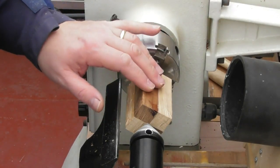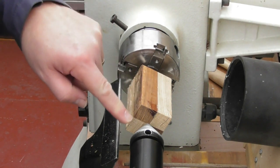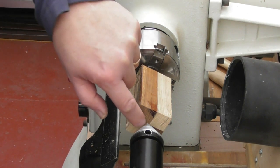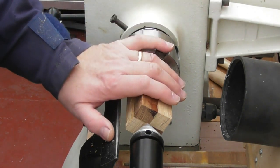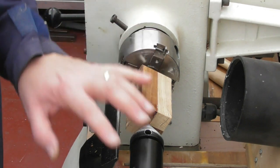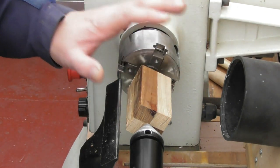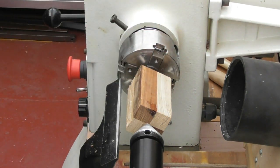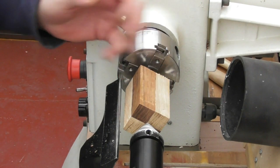The blank I've started with here today is one I've had glued together for quite a long time and in my infinite wisdom I haven't got it quite centered — it's not quite in the center on this back piece here. This is, as most of our videos are, a warts and all video. I'm hoping by the time it's curved off that the fact it's not quite centered won't be too noticeable. This blank is 80 millimeters long but obviously with this type of kit you can make it as long or short as you want — you're not limited by, dare I mention, the dreaded brass tube kits. So let's crack on and get this round and then we'll look at measuring to get the right sizes, then the final shaping and finishing.